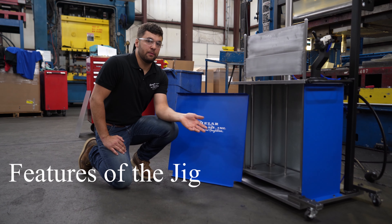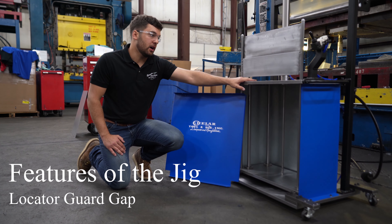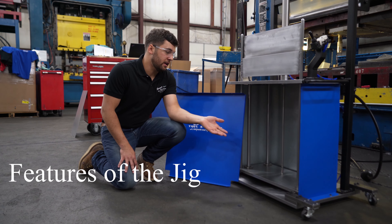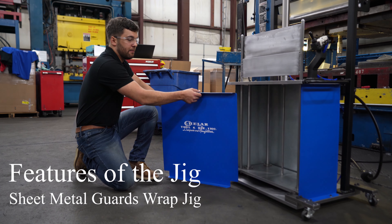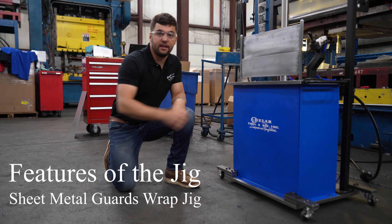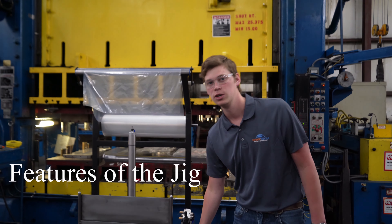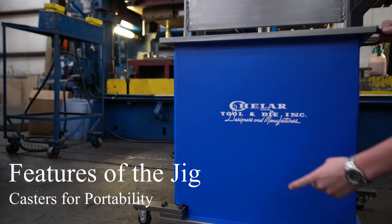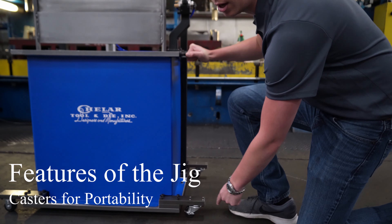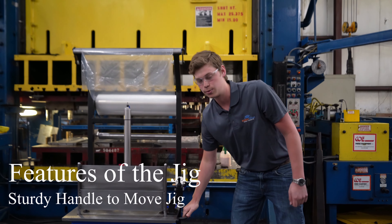Our main concern was safety. We designed a two-inch gap so that nobody could get caught in the vertical motion assembly. To keep people and debris out, we made guards that wrap the jig entirely, protecting both the components and the operator. Part of the issue with the original jig was it had to be moved with a forklift. Our jig uses four sets of casters — two stationary and two swivel — with locks on the swivels so it can stay stationary. We also have a handle for ease of use, making it very portable.